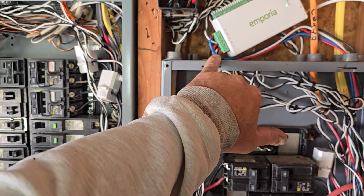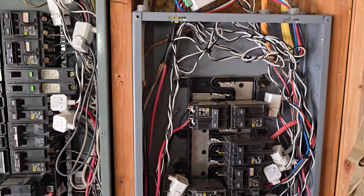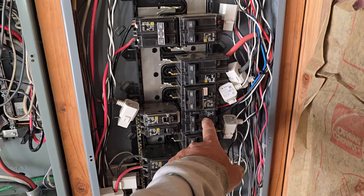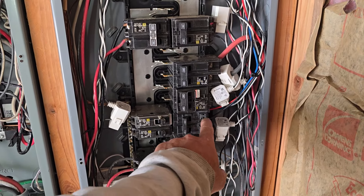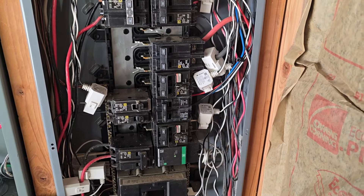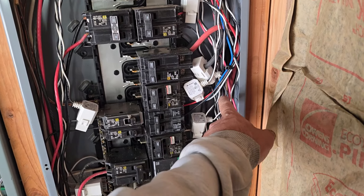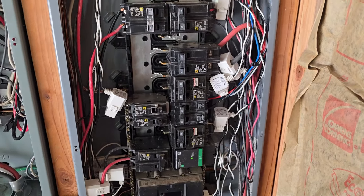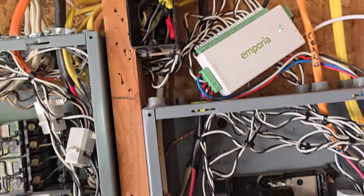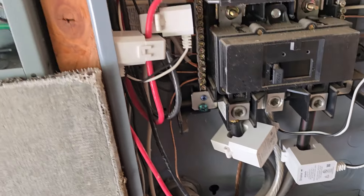On these wires, you've got the black wire and the red wire — those are supposed to tie into a breaker somewhere. I had a spare 220 breaker so I plugged into that, giving me both sides reading both sides. The blue and white are neutrals; the blue is for three-phase, but I don't have three phase, so you tie the blue and white down to the neutral ground.